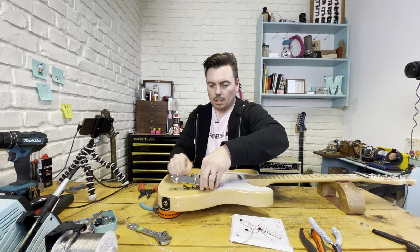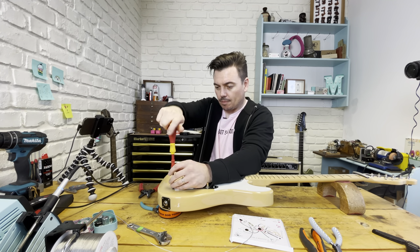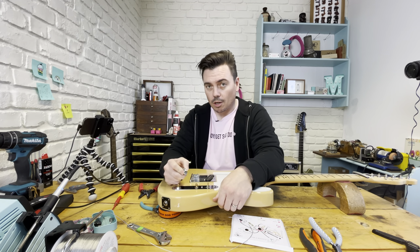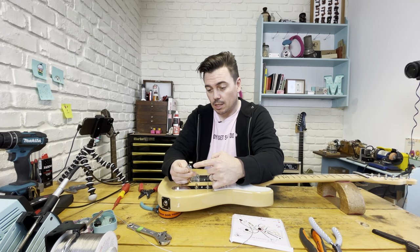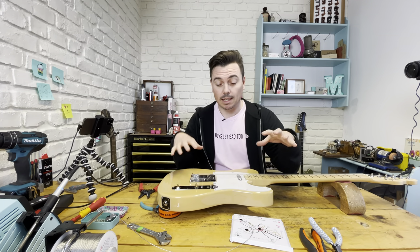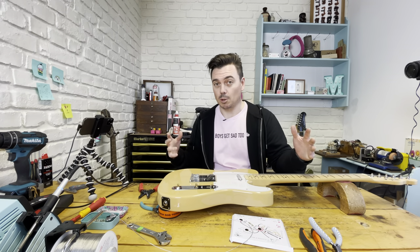Fold all this in, make sure it fits. Screw everything back down and let's try it out. Also, because these are metric pots they don't actually fit onto the imperial shafts, so I'm either going to have to replace them with imperial ones or drill out the knobs. That can be very tricky and potentially quite dangerous, so unless you really know what you're doing, just get some other ones. I'm going to get this tuned up and then go and record the same thing I played on the guitar before I started. Obviously we also have the addition of two more sounds - let's see what's changed.